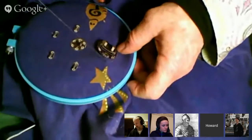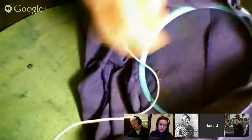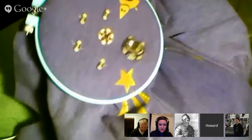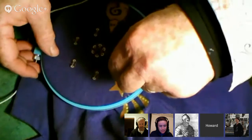The only solution that we came up with, although we haven't tried yet, is to use bare conductive paint and kind of blop it on. So basically you have your physical joint by sewing it really tight, and then you just seal it with bare conductive. That's a great idea. We haven't tried it yet, but that might be a way of assuring against the loose connections by gluing it on as well as sewing it. Right. Yeah, that's really good.